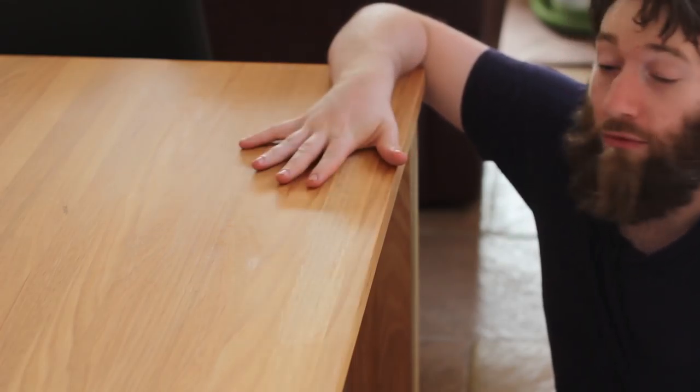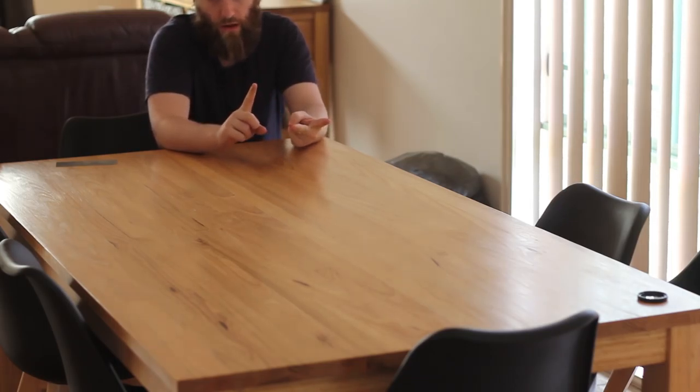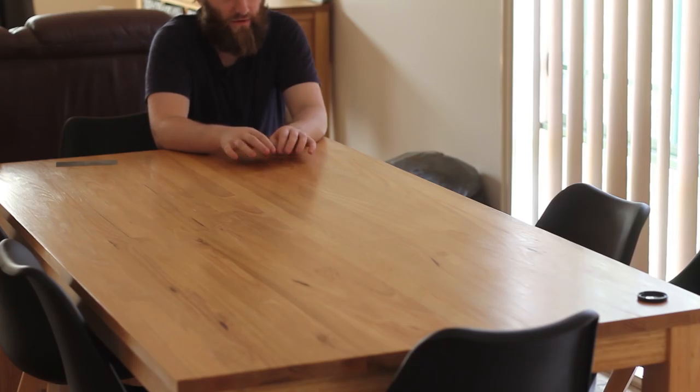What I'm going to do is strip all the finish off and refinish the top. Unfortunately I do need to strip the entire table down because the layers of polyurethane — you'll very much see ridges in them and they'll never feel entirely smooth. The quickest way to do that is not with sandpaper. You could use a belt sander or orbital sander and try to strip the whole table down, but that creates a lot of noise and dust, may make the table less level, and because this is polyurethane it may not sand as nicely as you'd expect — it'll gum up the sandpaper. So instead I'm going to use a card scraper.